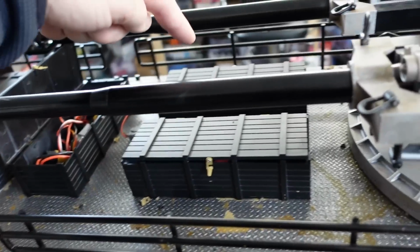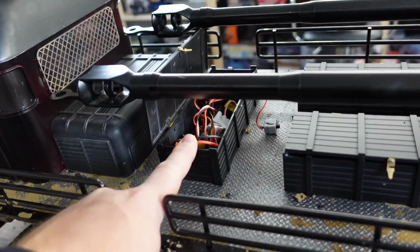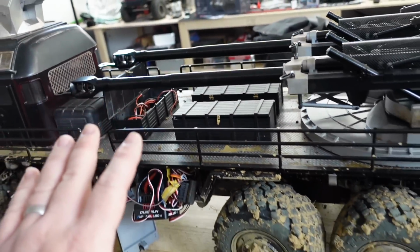I think it was this LiPo or that side. One of them was basically charging the BEC. It was backfilling the BEC. So I disconnected the power line from this ESC as well, and then on the next run, no issues, and longer run time as well. And yes, before you say it, and others have already said it, I was an aircraft electrician for 24 years.